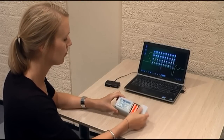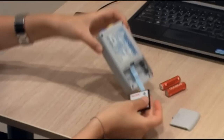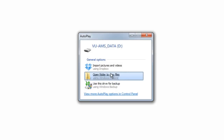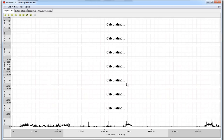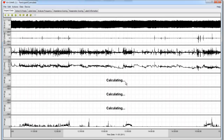To extract data from the device, remove the batteries and remove the compact flash card. Place the compact flash card in the card reader. Then move the .SFS data file containing the recording to a designated directory. Double-click to open the recording for further processing, or start the DAMS program and open the .SFS data file through the File option in the menu. The data will load the Inspect Data screen, which gives you an overview of all recorded signals. To speed up data processing, save your data in .AMS format by clicking 'Save' in the menu.